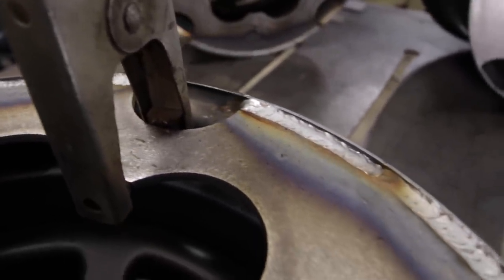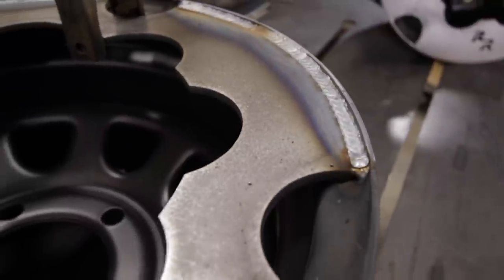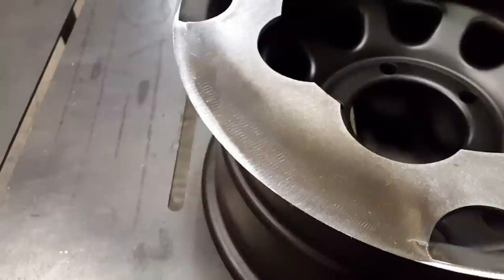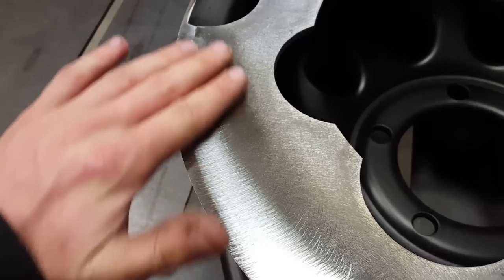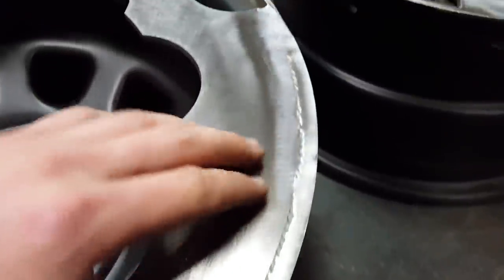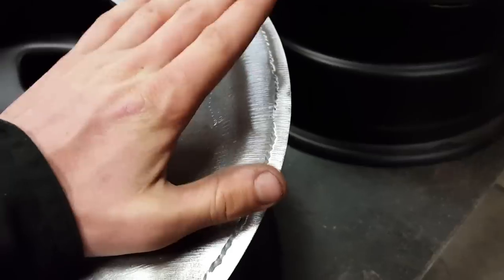Here it is, freshly welded and still too hot to touch. Next thing to do is sand this down after it's cooled — I'm going to do that with a flap disc. You want to try to hold the flap disc as flat as possible and you'll end up with a nice result. If you don't fill it up high enough with the weld, you're going to end up with a bunch of ugly low spots. The solution is to go back and fill all those with weld, because you'll just make more low spots if you try to sand them all out.